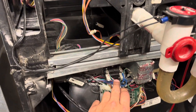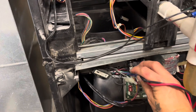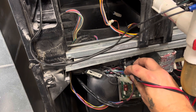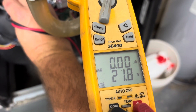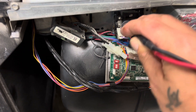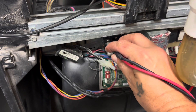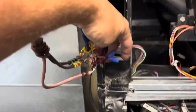I've got something really peculiar going on with this relay here. This is just the emergency heat relay, but it's clicking on and off even though my voltage is not dropping. I need to re-tap this unit with 240 volts. I've got a loose connection somewhere. It seemed like it dropped out before and I still had 24 volts applied — I'll have to go up there and check that also.